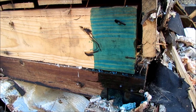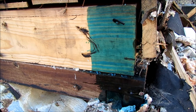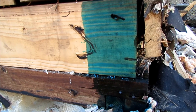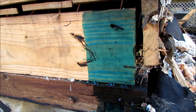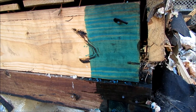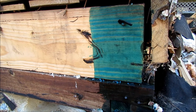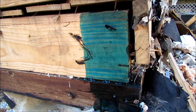What we're looking at here is the framing on another house — I figured I'd show this in daylight so it's easier to see. You can see where I've applied this product to the rim joist and that support beam below, and the contrast agent lets you see where the product's been sprayed. If you're about to build a house, you want to treat all your framing prior to being enclosed, and if you're proactive there's a good chance you may prevent termites right off the bat, and also other insects as well.